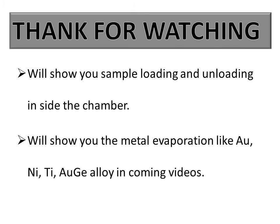So this is the Penning gauge here. When you turn on the system, the pressure inside the chamber will be more than 1e-3 or so. These are high vacuum gauges, so make sure the pressure has already gone below 1e-4 when you turn on the Penning gauge. Make sure that you never turn on the Penning gauge as soon as you turn on the system. It should be turned on only when the high vac valve is open with the turbo at its maximum speed.